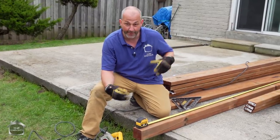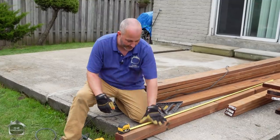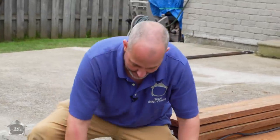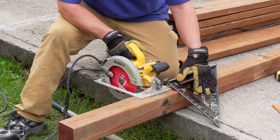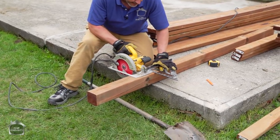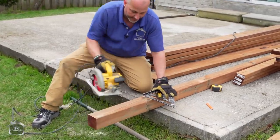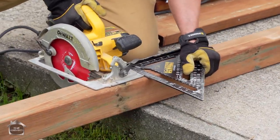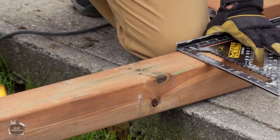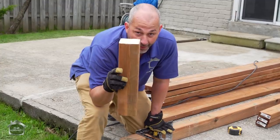The next step in getting prepared for our box beam is to cut our 4x4 posts. This will act as our structural load post that goes in the concrete blocks. We have six holes and one of these 8-footers - we're going to cut these all at 16 inches for now. Once we get it measured we can cut it all back later. We'll use our square to get the saw in the right place. Most circular saws won't cut a 4x4 post in one pass, so use the square as a guide, rotate the beam, line up the blade, bring the square up against the plate, and cut again. Roll it one more time to finish it off nice and square - perfect every time.